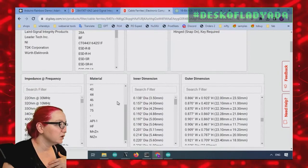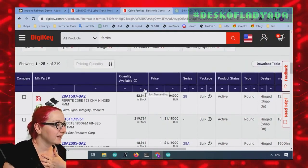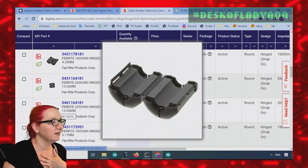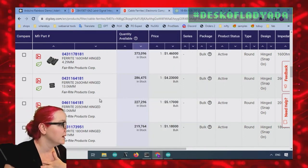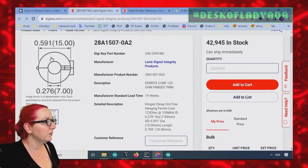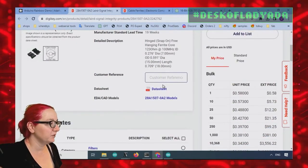The material is going to affect the response curve. I just looked at the most popular one, and there were quite a few options. It looks like Fair-Rite — which is just a good name. A lot of these are good. I found this one — they had 43,000 in stock, it's nice and small. What I liked is that it had a pretty big inner diameter — a quarter-inch wide cable can fit through it — so this would do the job very well. And of course it clips on and off.